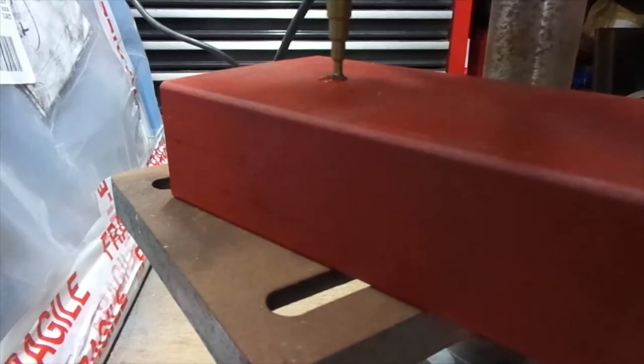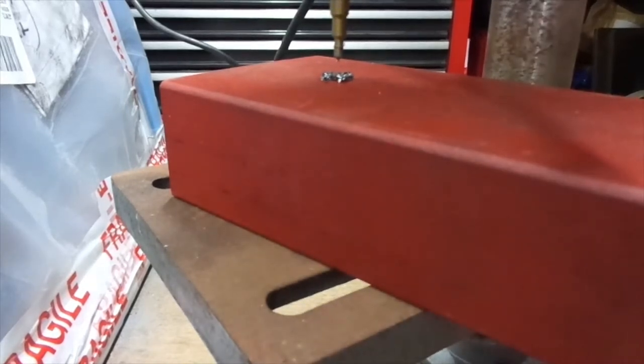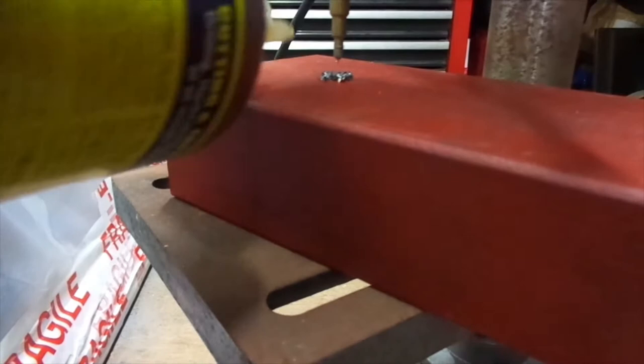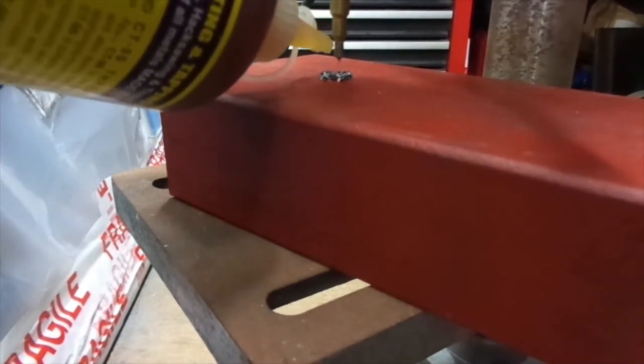I'm getting some chips. It's cutting, but I'm gradually increasing the force. That's another reason for using the cutting fluid. If you see it's starting to smoke, you know your drill is getting a little bit hot. You don't want the drill to overheat, otherwise it'll lose its temper and be useless. Just adding the pressure a bit more. Sensing I need a bit more lube. Don't put it on the drill as it's rotating because you'll just wear the applicator end away.